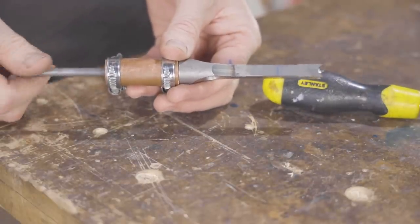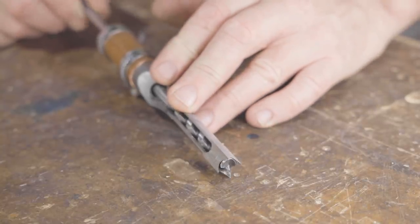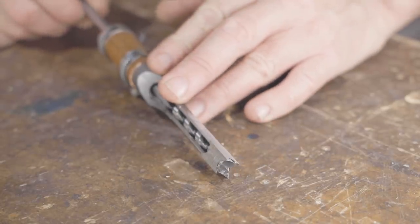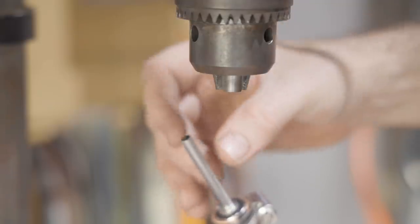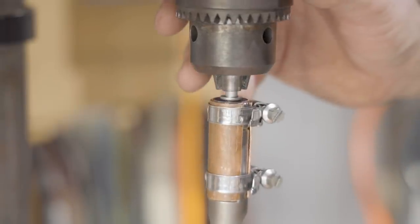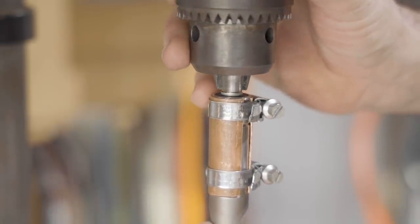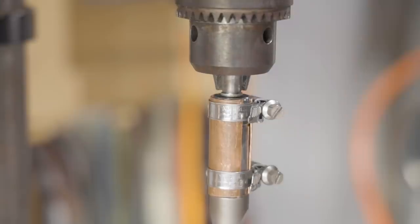I'm not sure how these are set up, but there's a recess in there that the end of the drill bit sits in. I wouldn't think that should be running tight in there because the end of the drill bit is just going to get hot, so I'm going to set it up with the drill bit pushed forward ever so slightly. I'll put a small washer on there just so it's not pushing directly onto the bearing. To set that drill bit forward slightly I just need a little bit of play when I set the chuck — that should do it, just about a millimetre or so.